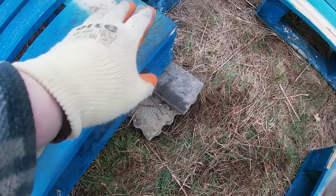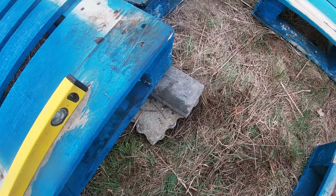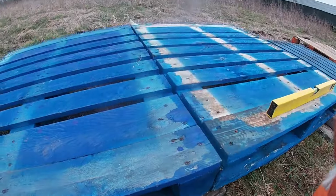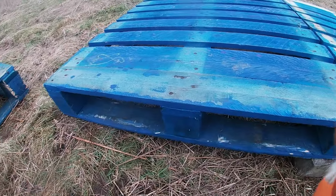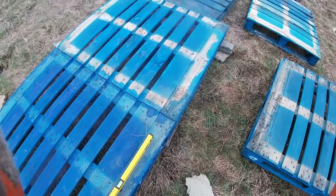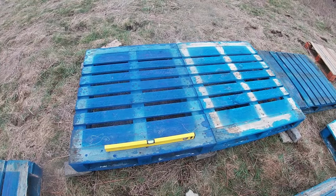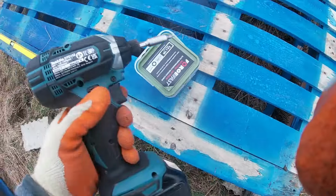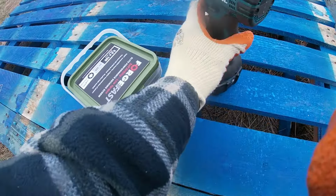Leave the brick from the previous levelling poking out on the corners, like so, which then gives you the perfect level for that corner on both ones. So you're just levelling one side at a time now. And hey presto, 2 level bits of the shed base. Now we've got a good bit of level going. It's time to lock some corners together.